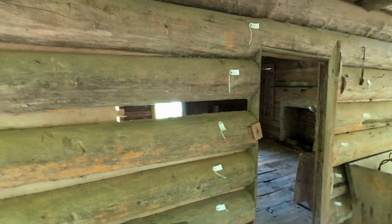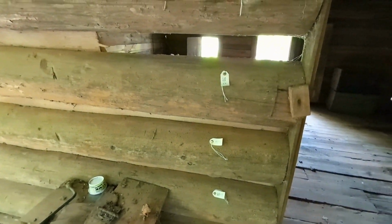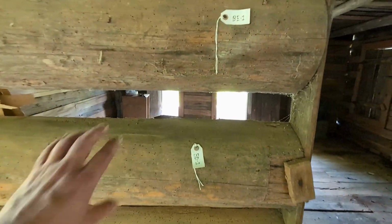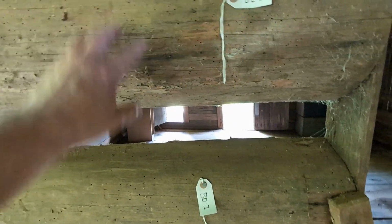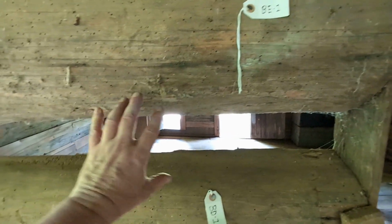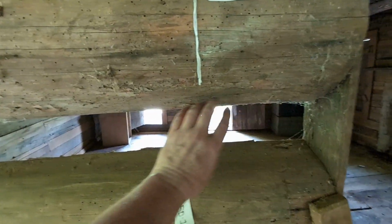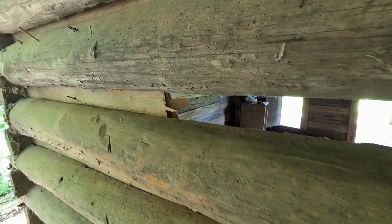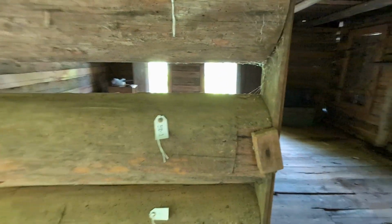And what's always fascinated me a little bit, there's no chinking. I've always thought that with a log cabin you were supposed to try and get the logs as close together as possible, but the more research I've done, this gap is actually good because it allows for the logs sort of to breathe and there to be a little bit of a gap between the logs to let the rainwater wash off, and you're supposed to fill this with chinking. In this particular case, they've just got some like panel board that they had tacked up here.